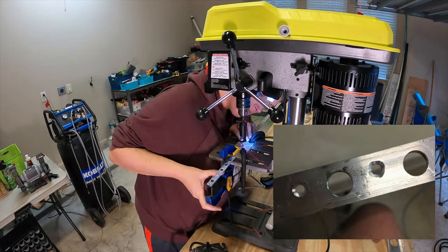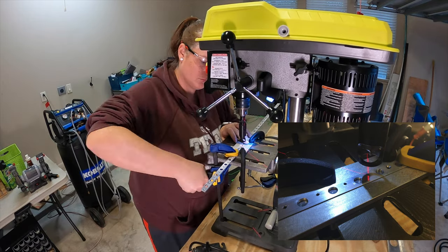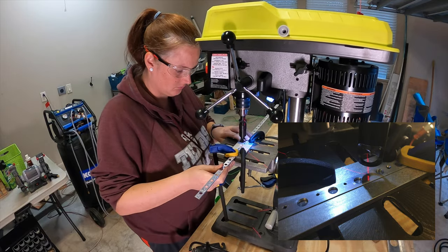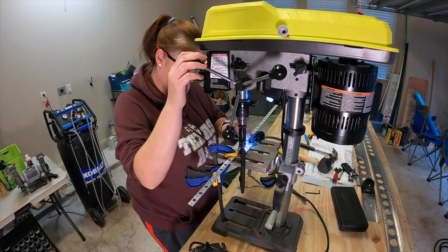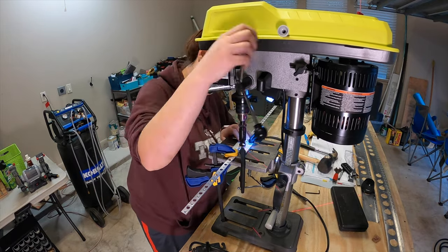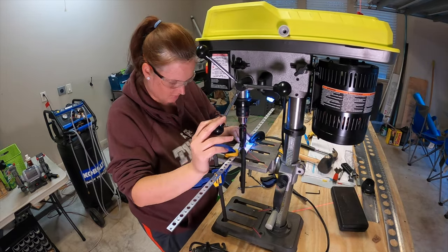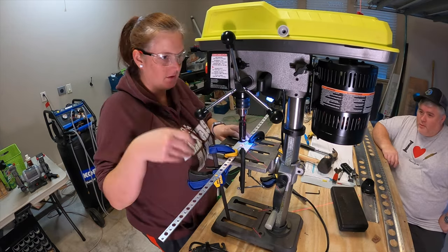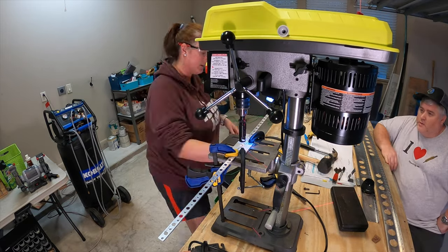When that hole gets enlarged and you're just holding the drill by hand, the tip of the countersink cutter can just move around and cause chatter, like you can see in that picture from when I did the rudder. But when you have it hooked up to the drill press and everything's clamped down, you line up that cutter with the hole, and even though you're enlarging that hole as you cut, because everything's fixed in its orientation, you won't have that same problem. It'll cut in the right place, nice and smooth.